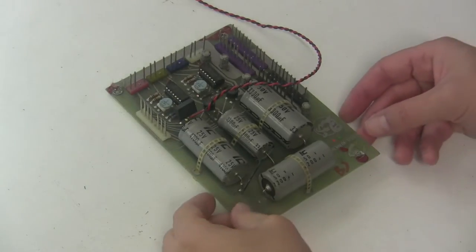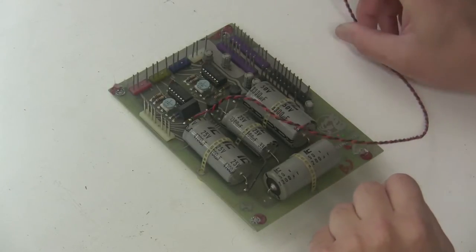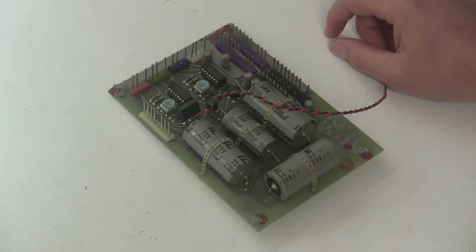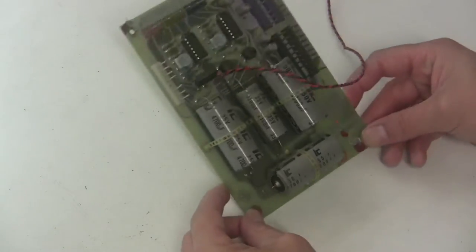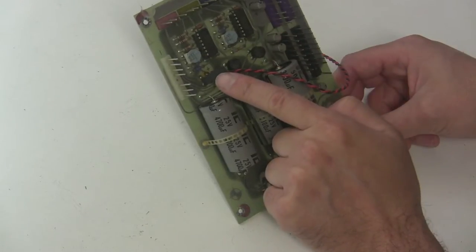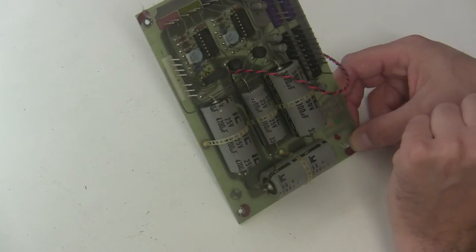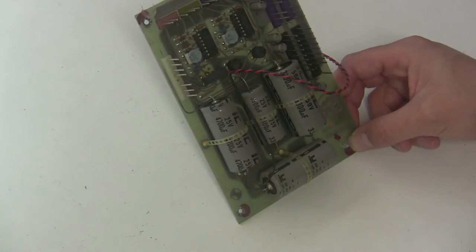This is the power supply that's been removed from the synthesizer. It has an additional connector for the Kenton MIDI kit, and there was also another wire soldered at the negative terminal of one capacitor, possibly also for the Kenton kit — so someone has worked on this power supply before. This is what the original bridge rectifier looks like — it's a one-amp bridge rectifier. Someone has replaced the bridge for the five-volt rail with a beefier bridge rectifier, which is a very good idea. These bridges run very, very hot and are a common failure point in the OB series synthesizers — I've seen them short out and blow the fuse.